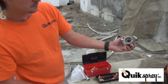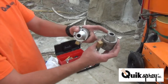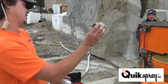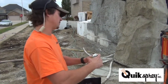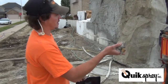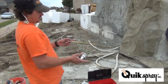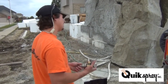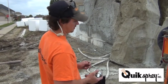These are called eight air jet nozzles — there are eight air jets inside. The second kind of head has the same body but a different head: it's a stainless tip with a much bigger hole for passing larger aggregate, fibers, or when you don't need a pretty texture finish and want maximum output. To run this combo you need at least 120 CFM, and ideally 180 CFM, especially if you're putting a lot of air through the gun — that'll keep everything from stalling.